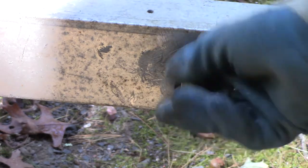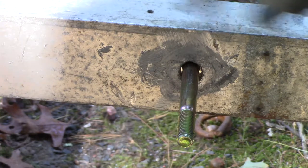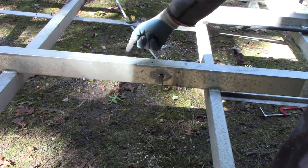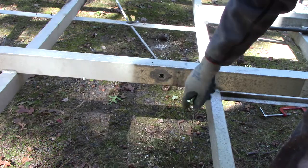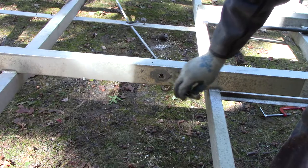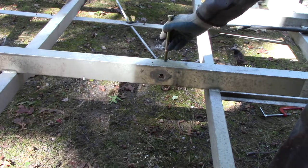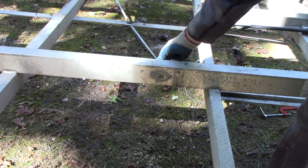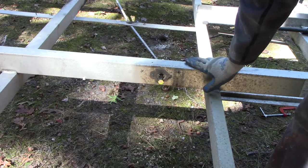Now there's a big chunk of solid wood in there. Even if I have to drill something through later, there's no way this is going to crush - it's solid. Plus with this bushing in here, it's not going to wow that wood out. This hole is supposed to be just the size of that bolt, but over time everything got chewed up and wowed out. The tongue part has that big block of aluminum so there's no chance of it wowing out anytime soon - maybe a hundred years. Now the bolt will come through and the assembly will be solid.